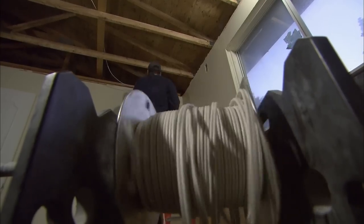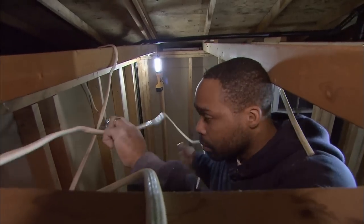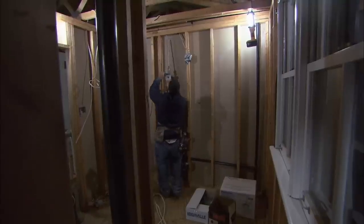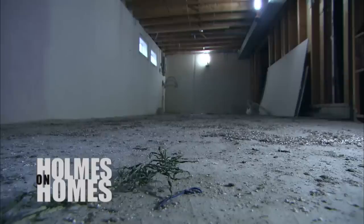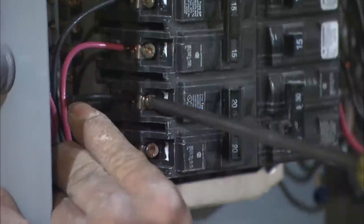Hydro's losing a ton of money due to grow-ops, and we have no real way of knowing exactly how much because there are so many we don't know about. Because of situations like this, there's no way to detect it. In this case, we saw seven 60-amp breakers on a 200-amp panel. They could be using anywhere from 100 to 700 kilowatt hours a day in a place like this. A normal home uses about 45. Two out of every three houses used as marijuana grow-ops have hydro diversions, so that's costing everybody money.